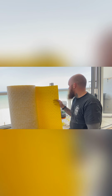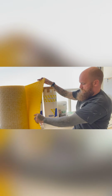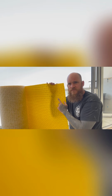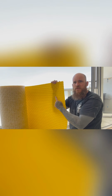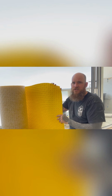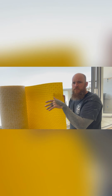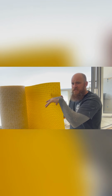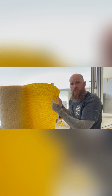This is Durabase. And I don't know if you can see this, but it's got towers. Now these towers, the wire sits in between the towers. For old school, you just used to lay the matting down, then self-level it, and the wire always used to ping up, it's just a nightmare. And sometimes you had the chance of catching it. But now you can lay this, it's fleeced back, you prime the floor, S2 adhesive, put it down with a 6mm trowel, and then you lay this mat in. I'll use a roller, I'll show you a video.